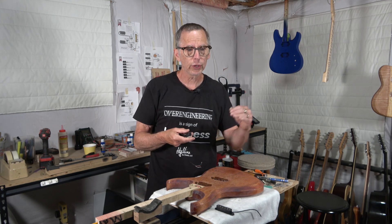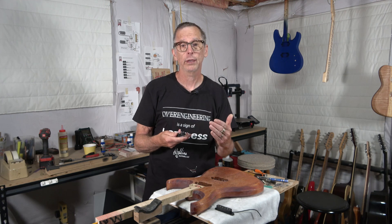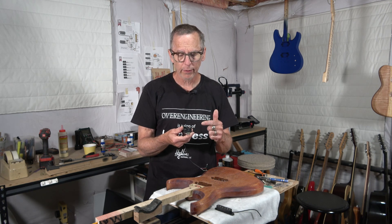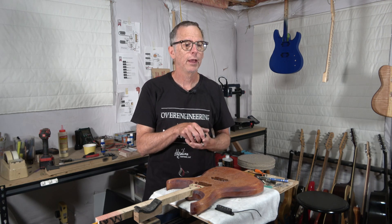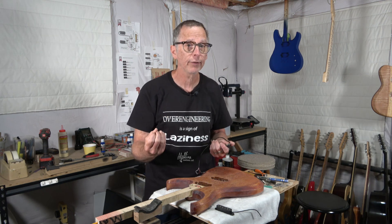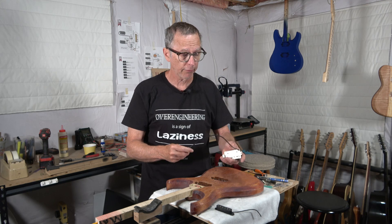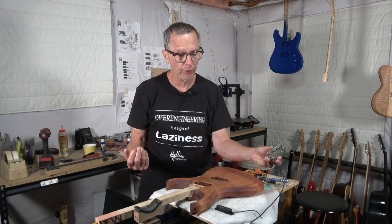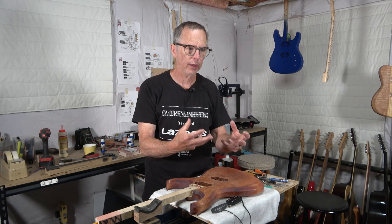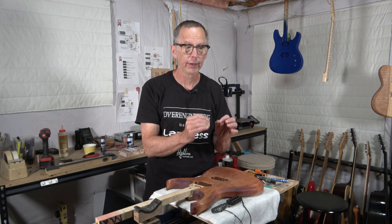So if you're looking for a certain kind of tone, you can shop through pickups based on their specifications — the number of winds, the type of wire, the type of insulation on the wire, the kind of magnet used. Those are going to help you determine what kind of tone the pickup will impart, and you can select it feeling relatively confident it will help achieve the tone you want. Different types of pickups produce different tones: the humbucker produces a warmer, darker tone, whereas the single coil Strat-style pickup produces a brighter, twangier tone.